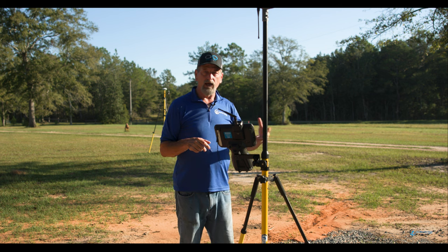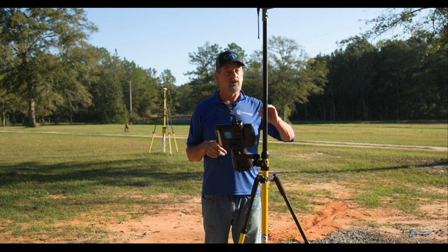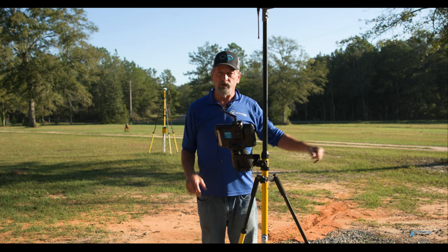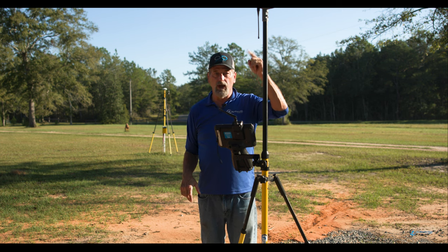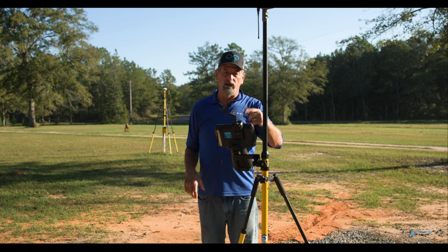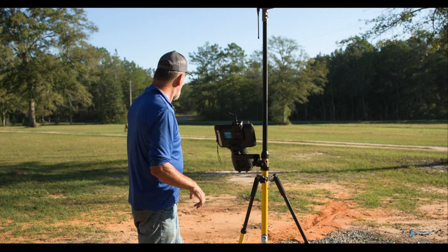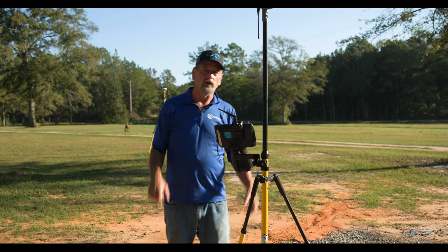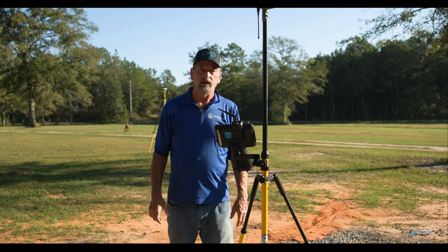Back in the day, my guys, whenever we did a Lowe's, a Home Depot, Walmart, or something like that, we always tried to set some control points off-site somewhere in case something happens. So we're going to do that so that I can show you guys how, to me, this system works and how you need to do this. Because where that base is sitting is inside the property line. In the real world, it's probably going to get knocked out, right? It's on the site. That can be a problem.